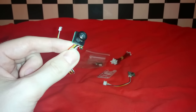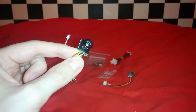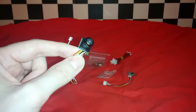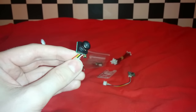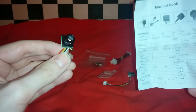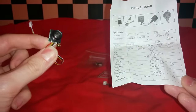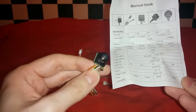Here is what the camera looks like. According to the specs on Banggood, it has a field of view of 170 degrees, compared to the FPV hobby wide angle lens which claims 110 degrees — we can check that out later. A slight anomaly I noticed is the spec sheet that comes with it says the voltage range is 5 to 12 volts, but the Banggood website says 3.7 to 5 volts.